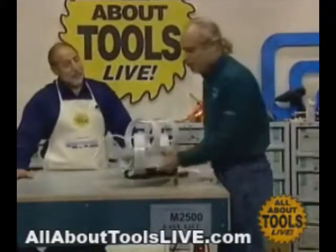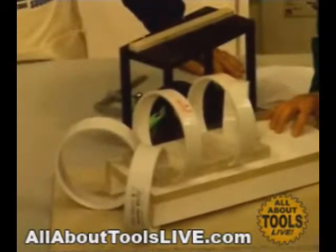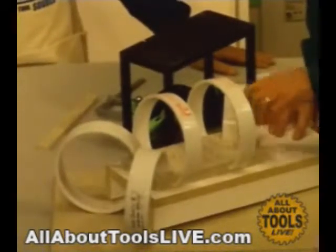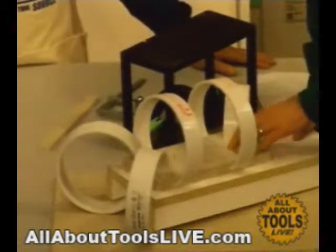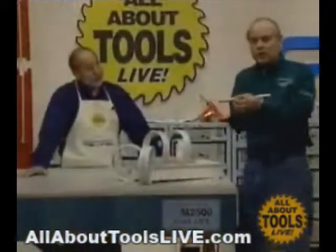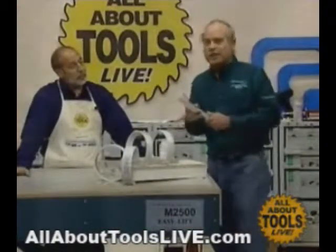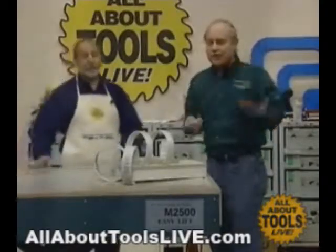Some fabricators say it takes longer, but it really doesn't because you've got so much to do in solid surface work. The setup time and the time you save in routering and sanding — you can actually save about 35% on a kitchen in fabrication time by switching to this method. The other thing is you don't have to worry about your particulate going through the material like you'd normally do on a stacked layered edge. Some fabricators will do one edge and another edge on top, which is very time-consuming.